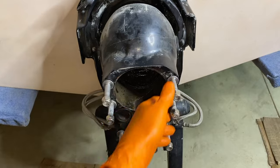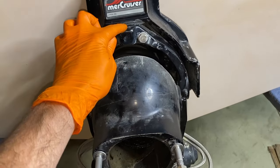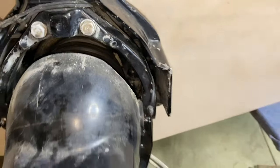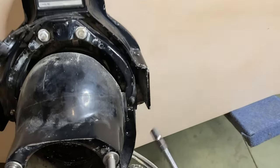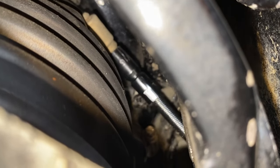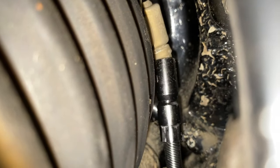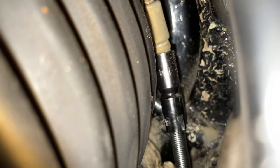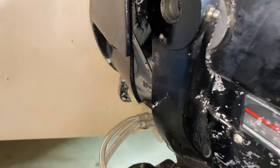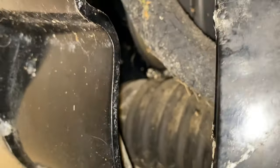I spent about 10 seconds carefully pulling the bell housing outward to widen the gap between the bell housing and the gimbal ring. Now we can come inside and see the U-joint assembly bellow — on the back side is a large worm gear clamp with the securing screw to the right. Grab the adjustable shaft screwdriver with a quarter-inch socket, position it on the worm gear screw, and carefully begin unscrewing. The clamp is now loose.